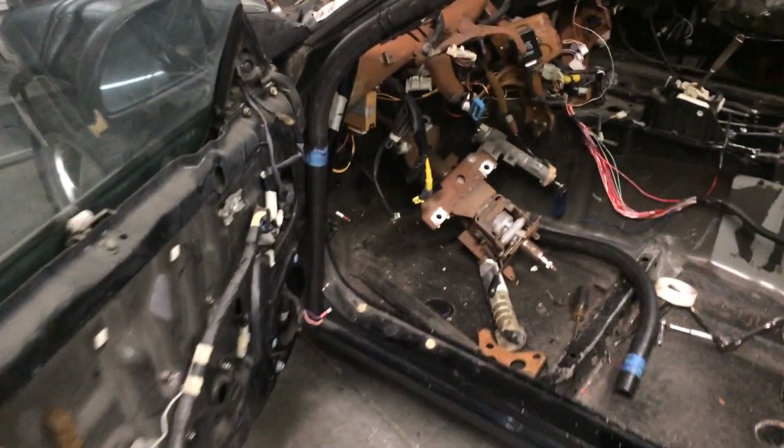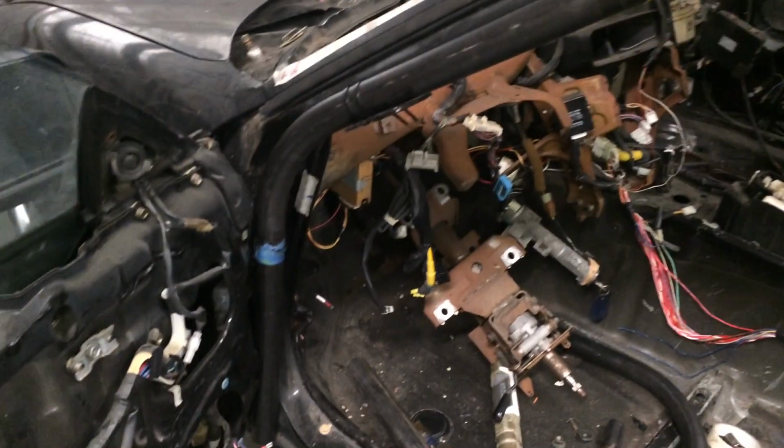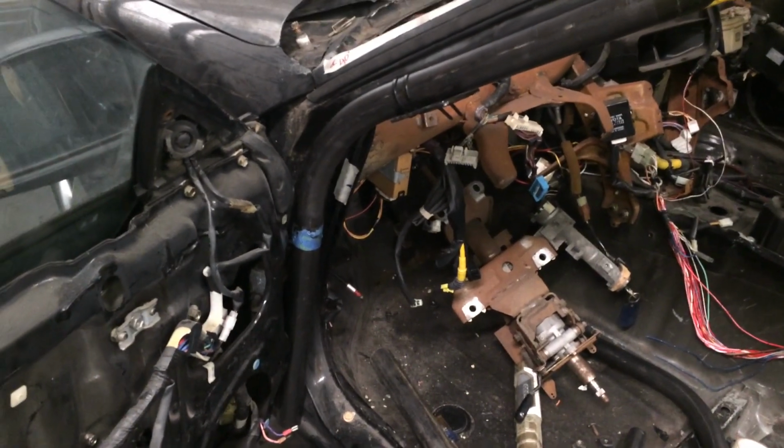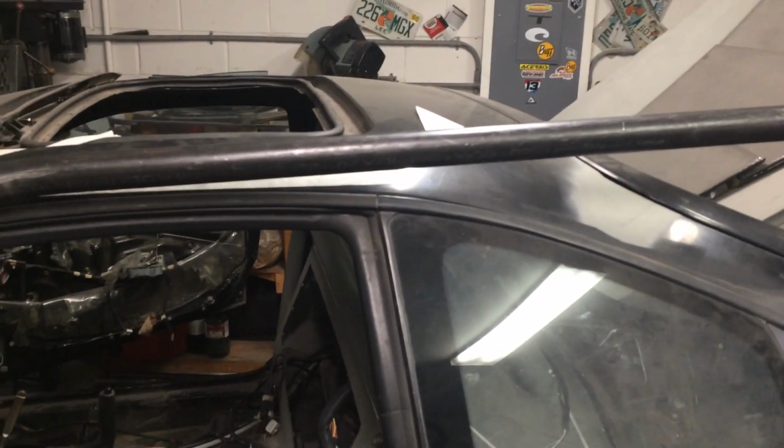Okay, so I took the first tube out of the machine, just kind of roughed it up against the outside of the frame, and it looks like it comes up a little high there, and I need to attack this angle next because it needs to go down and tie into that part of the cage. So that extra length is just because it's on the outside, and it will go further in, and I'm probably going to have to cut about an inch off the bottom of that, but it will fit into place, so we're going to try and figure out that angle now.